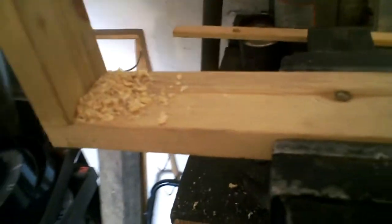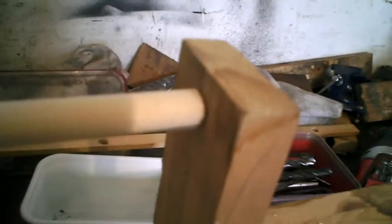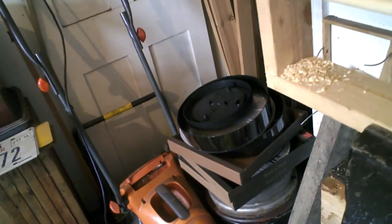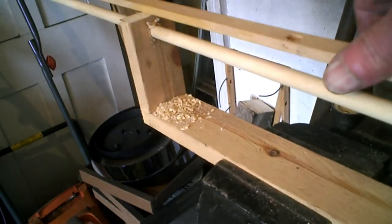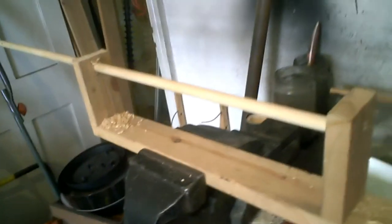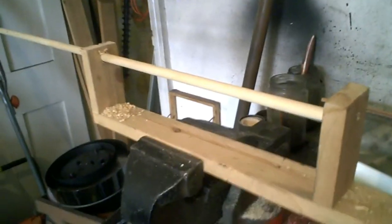What we're doing - just a very quick little jig. That goes through that end like that, and I've done it in half length, so that'll go through there. I'll drill a hole in there, and then I can put my drill on, put a hole in there and run the wire along. Then getting my angle grinder with this thin disc on - if I put a straight edge, just screw that along the top in the middle as a straight edge, I can then just whizz along it with a grinder and cut the links off. They don't have to be as good - we're only doing it for something to do, ornamental.